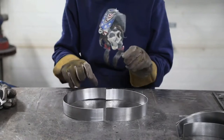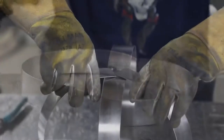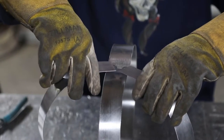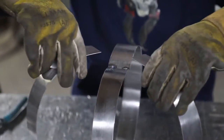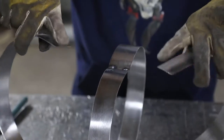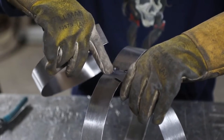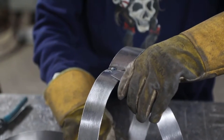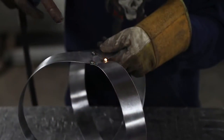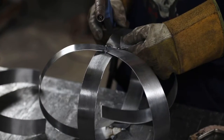Because you have six pieces, we're going to put these on in sixths. Once you have your first loop done, take two more and see how they lay out to get them even. Go from the corner, get these corners back to a point, get yourself close, and then tack weld the top on each corner and go down to the bottom and do the same thing. You'll be able to move it a little bit and tack weld once on each corner there also. Repeat the same thing on the other side with the last two strips.